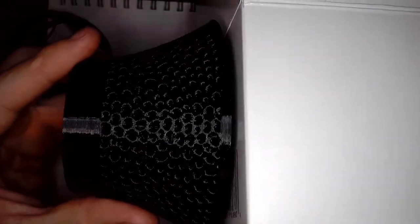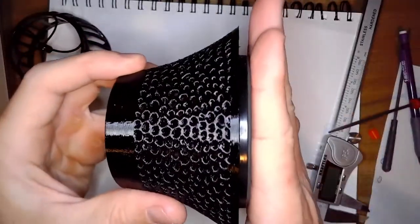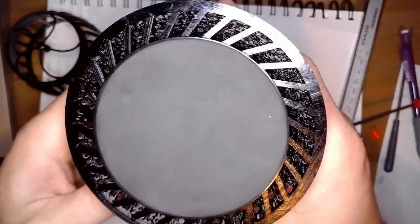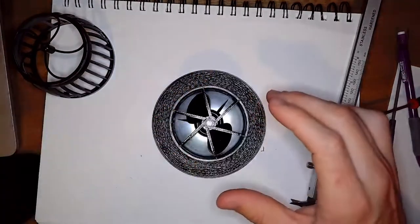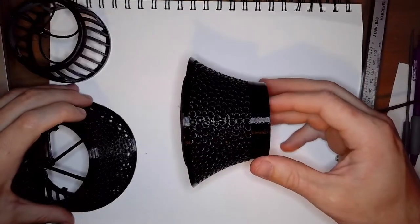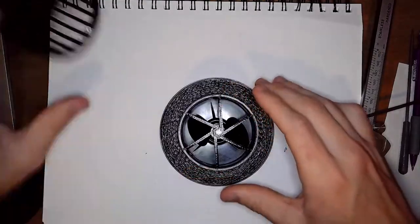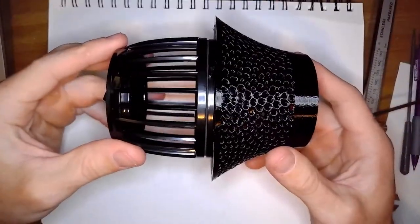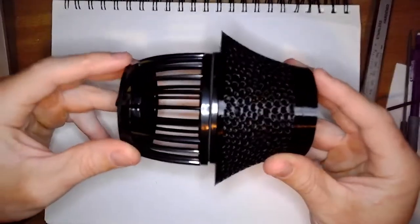Now, if you notice here, I'm putting it up against the box. Unfortunately, the light's a little messed up. I'm trying to show you how the MP40 sits on the glass and leaves this gap between the glass and the guard, allowing water to come in and through this little grate structure in the back to not restrict the flow. So even though the fine mesh structure on the outside of the pump is super small and could possibly get clogged, water can always go out and around the back and fly in through the back, so it doesn't restrict the flow at all when most anemone guards do.